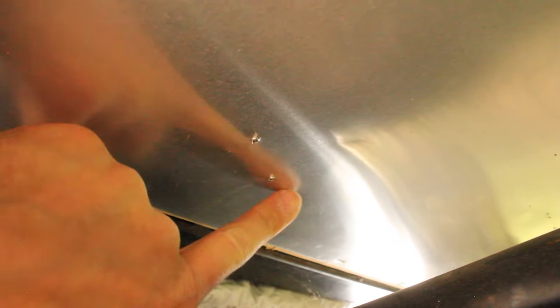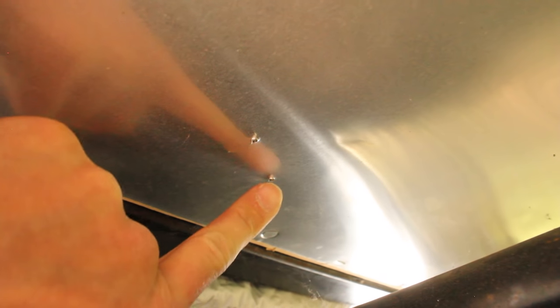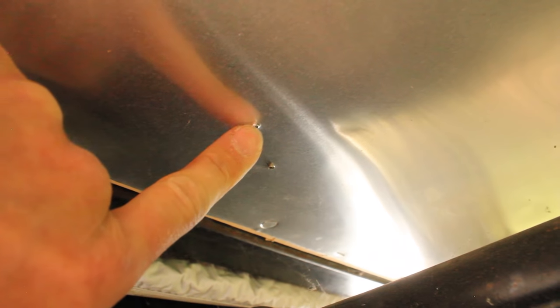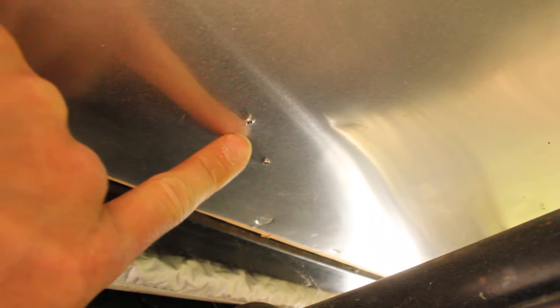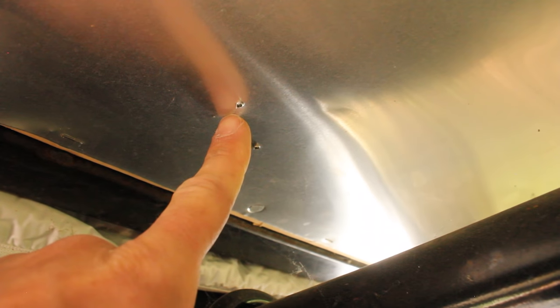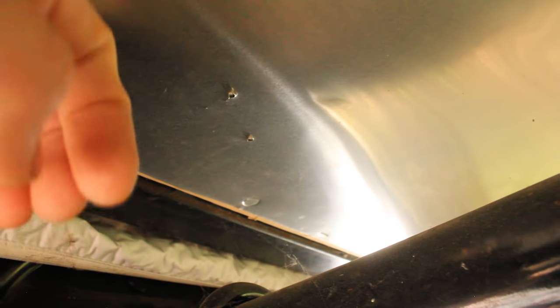Okay, I'm back underneath, and here's the old hole, the original coat hanger. And then I popped a new coat hanger down because we moved the hole forward a little bit. So I'm going to try to just cut out a bit of a hole here. And what's actually gonna work better is we're gonna push the tubing up from below. That way, if anything, we're pushing insulation up towards the floor rather than creating a gap directly under the floor, which would be worse.